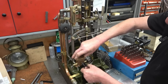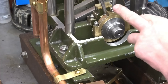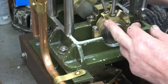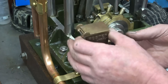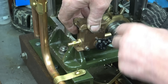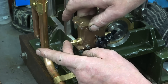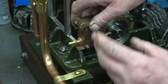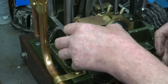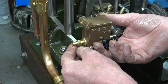I'll probably make a nice plate to support it on there. It works by that little lever on there turning that wheel. This part here is what they call an eccentric - it just operates the valve. You can see that it moves up and down. So if I make a little suitable linkage to come up here somewhere across and down onto there, we'll be able to make it so it cranks that pump around and around. I've got enough room to get that oil feed pipe in there. I'll take these oil pipes off so I've got better access.